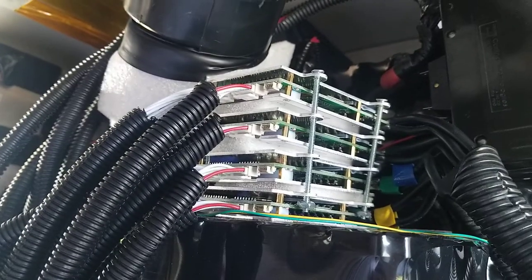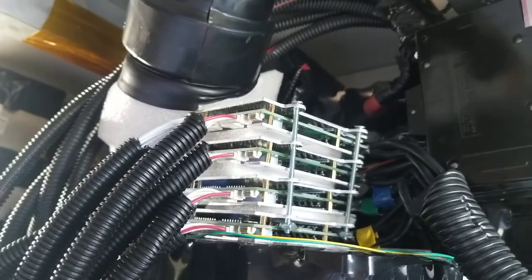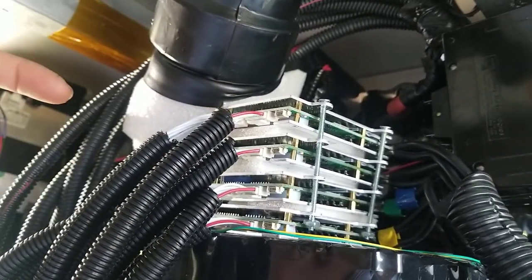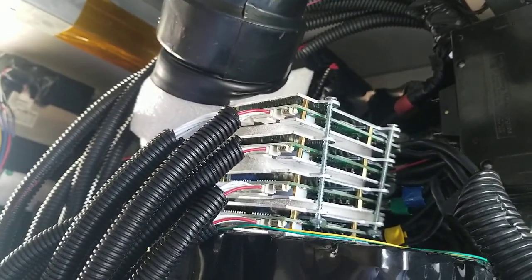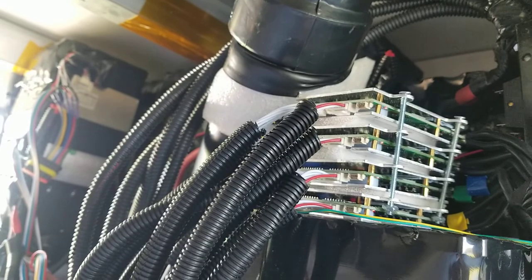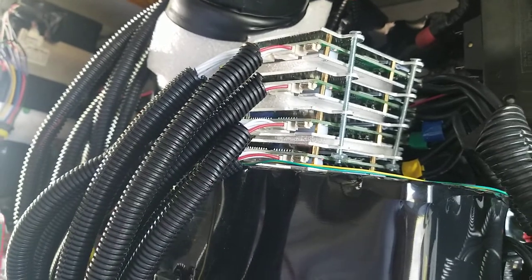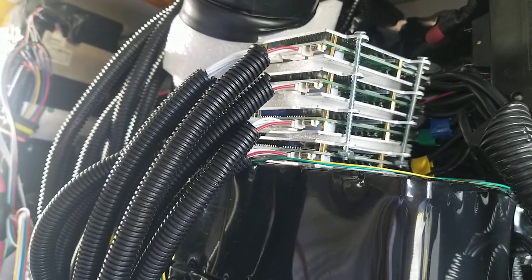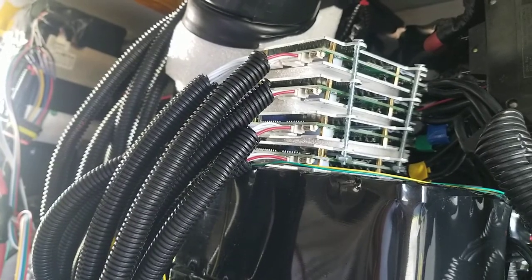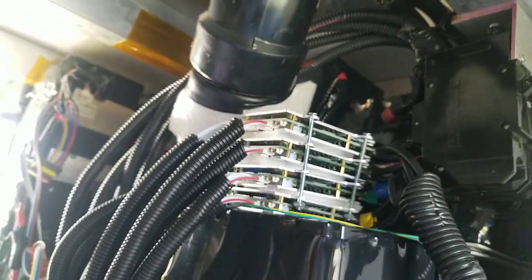That also would kick in if the battery hit some kind of warning temperature, like it got so hot that the cells might be damaged or so cold that the cells might be damaged. In that case, it will not turn itself back on again, and it'll force the system off. So we have a few safeties like that which force interaction with the user in the event that there's something that could be unsafe. Otherwise, everything is entirely automated. Even if the system were to run out of power at night with the air conditioner, the next day, once the system has enough power, it'll start everything up again. So you don't have to manually do anything. It's more or less automated.